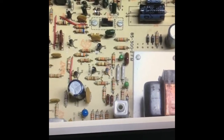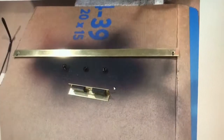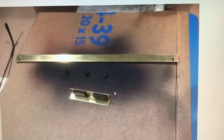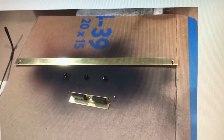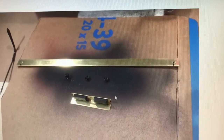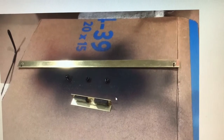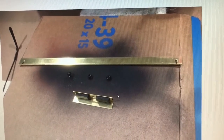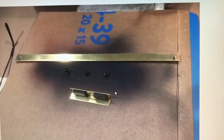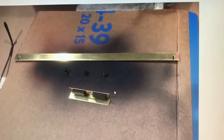I'll also include a picture showing you all the parts that I had to fabricate. Here's a look at the two pieces that were missing from this unit. The upper one is the indicator dial slide — that was missing and removed from the unit. The piece below is the backup plate for holding both of the meters in place, which had been removed and was missing as well. I was able to fabricate both of those out of brass and get this thing outfitted and put back together.